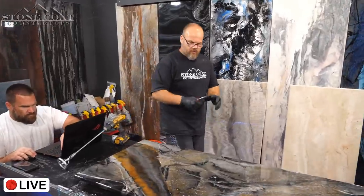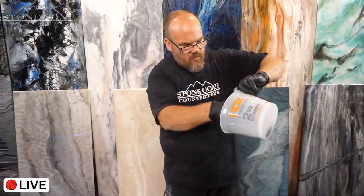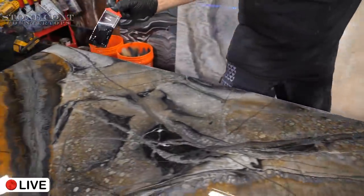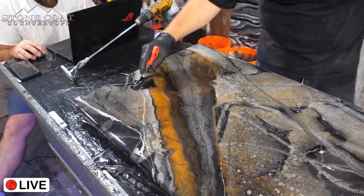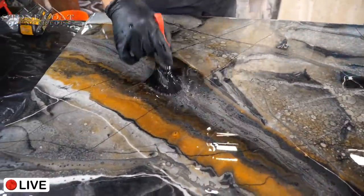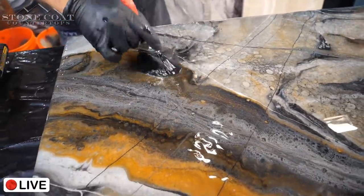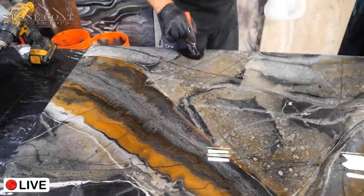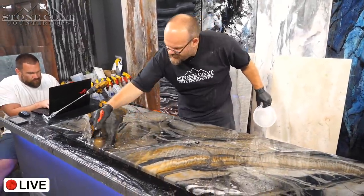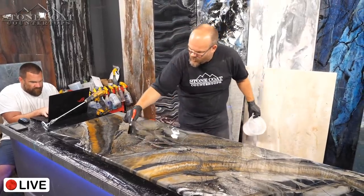All right, so chop brush, pull any loose bristles out. I'm going to grab my bucket and prime that brush, because if I don't, I'm going to pull up excess material and have a low spot. Now I'm just going to chop this. So what does the chopping do, Mike? Two things. It removes any trowel lines I just created, and it's my last hedge against under-mixing the material. It also breaks surface tension towards the edges. Maybe I didn't trowel it all the way to the edge. The chop brush is going to wet out those areas and promote the material flowing over.